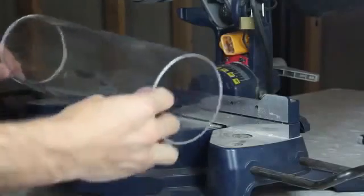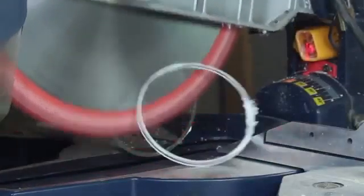It's time to cut this acrylic tubing to size. I'm using a chop saw to trim the edge smooth, then I'll measure 7 inches and cut nice and slowly so that I don't chip the plastic. As the blade cuts, the friction also helps heat the plastic, leaving a fairly clear edge.